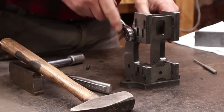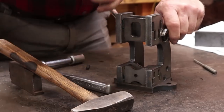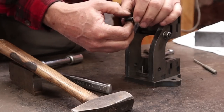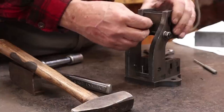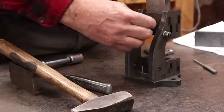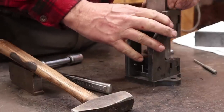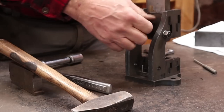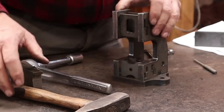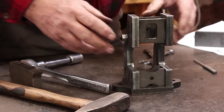I'm going to go ahead and tighten this up. The last thing is a little spring-loaded catch in the back — that means your dies can be locked in so they slide but don't fall. You can leave it sitting up while you go get your next heat, which is an interesting feature. So that's it, and it is good and solid. My guess is there's no need to weld this, and you can always take it apart and reconfigure it if you need to.